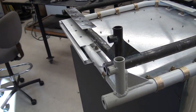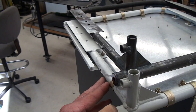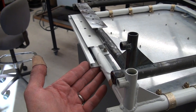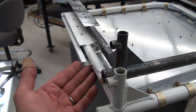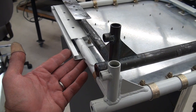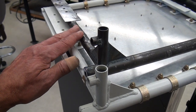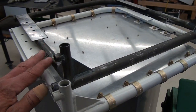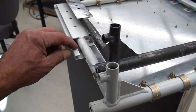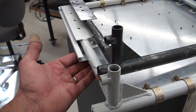And the seats are no exception. This bottom seat frame — the one that's painted — is a seat frame from the factory, and you can see that it has this little sheet metal guard. There are actually two of these: the pilot's and co-pilot's side. This little sheet metal guard is on each seat frame to help protect the seat slide from any debris that might fall in there between the seats. These seat frames are turned upside down. This is the seat frame that I'm making — basically a copy of the factory one. This little sheet metal guard has got about a half inch cord, a 90 degree bend, a 3/8 inch gap, and another 90, and then that goes underneath and gets welded to the seat frame.